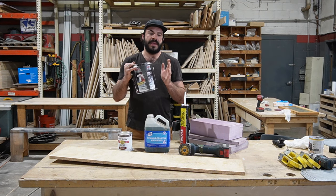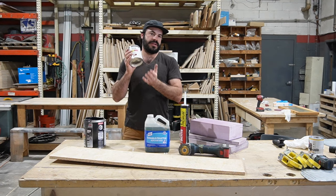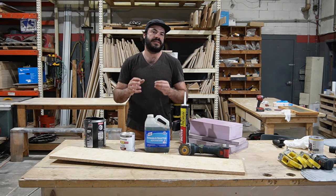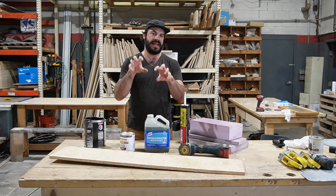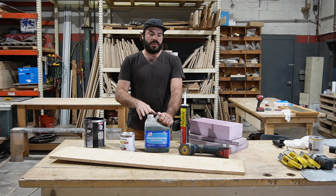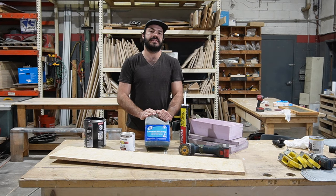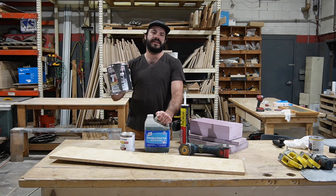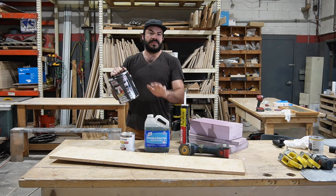things about it. What's different about this versus your Home Depot, you know, $30 a gallon, is that it wants to bond directly to a rusty surface. It needs something to bite into. So if you hit it with something like this prep and etch product here, it's actually going to prohibit the chassis saver from bonding as well as it potentially could. So that's something to be on the lookout for.